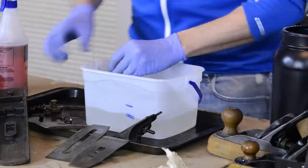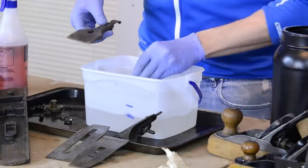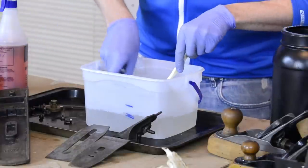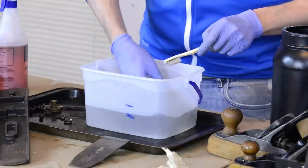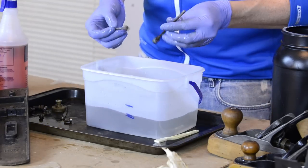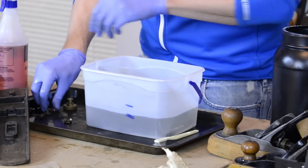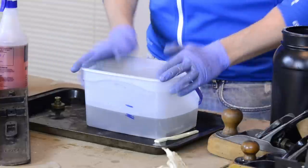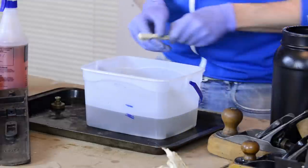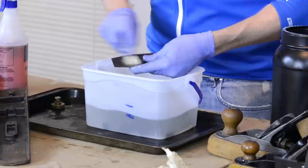The key is to just stick your metal parts that are rusted in. Drop all these parts in. The thing to watch for is that after about a minute or two, the solution should be bubbling up and loosening the rust. If it's not, add a little bit more citric acid and stir it in. My solution here is bubbling up, so I like to leave it for about an hour, or you could do a little bit less. After an hour you can go back and start scrubbing and the rust should come off.